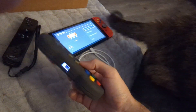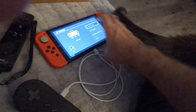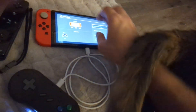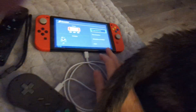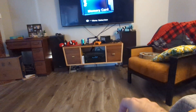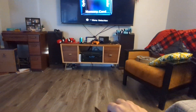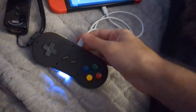I still need to work out a couple things, like how I want to handle charging notifications. I may end up disabling the charging feature if you're plugged into a SNES or GameCube, because the power draw on those systems — you're going to want less power draw from the controller in those circumstances. So maybe just over USB connections and charge connections.